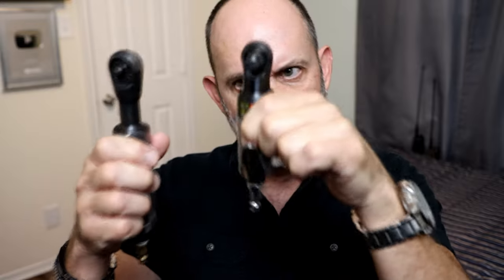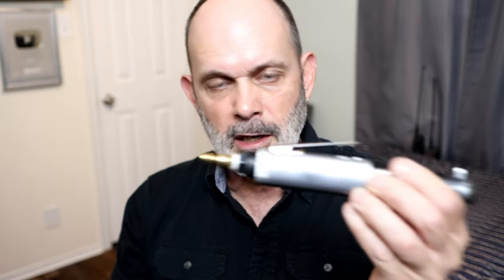I couldn't figure it out, so I got myself a smaller, stubby air wrench. This is a three-eighths; this is a quarter-inch. The smaller one worked great on the hose, which proved the problem wasn't with my air supply — because this one worked great and the other one did not.